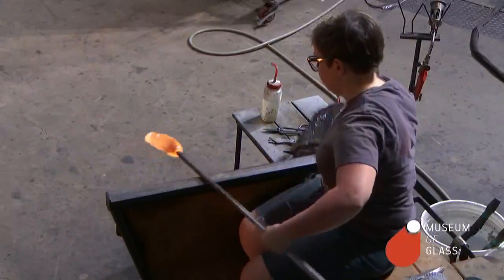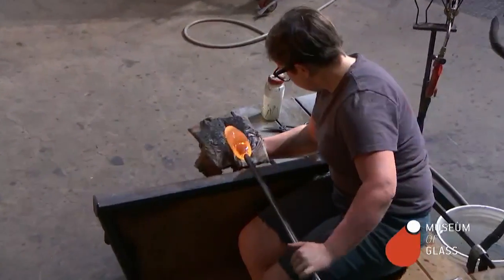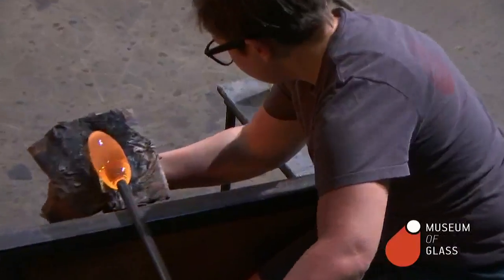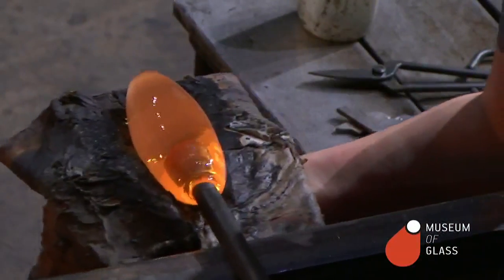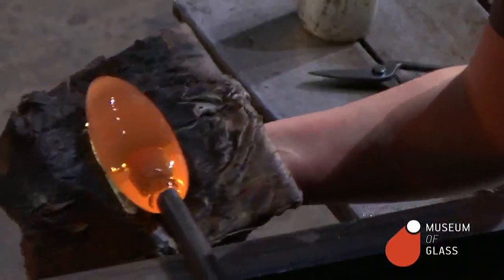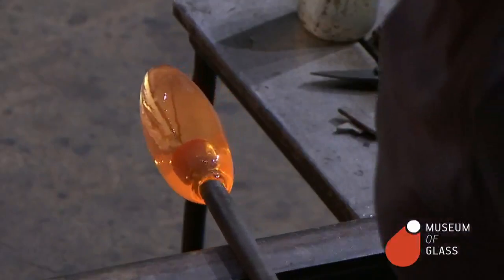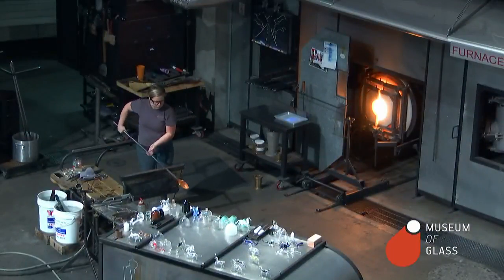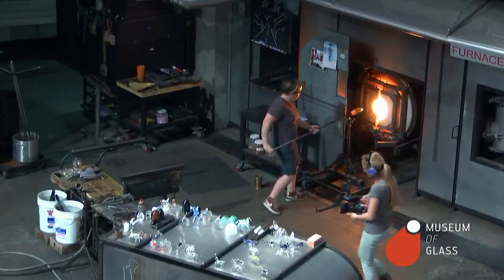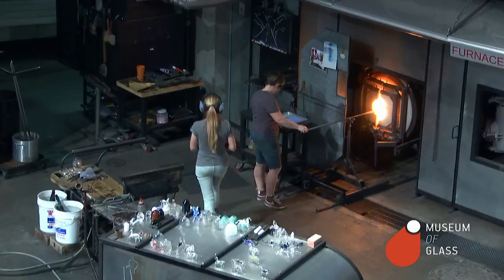One of the shaping tools we're using down here in the center, but also down in that left-hand side, as we see Sarah just rolling back and forth on that wet pad, well, that's actually a newspaper pad that we use here at the museum. When we're burning newspaper, we prefer to burn the Wall Street Journal here at this museum, but any old newspaper will do. We fold it, drench it in water, and we burn right through this material.